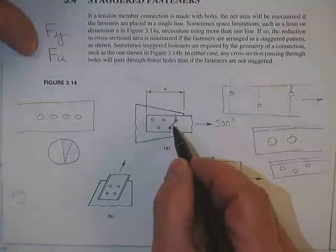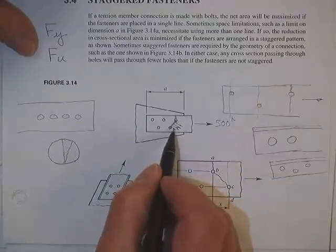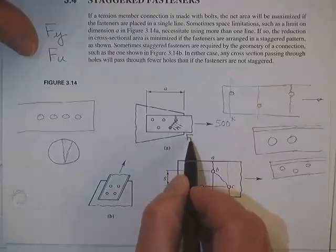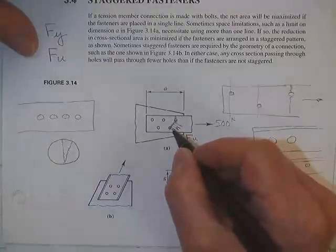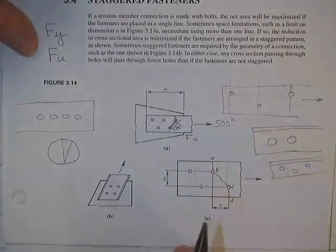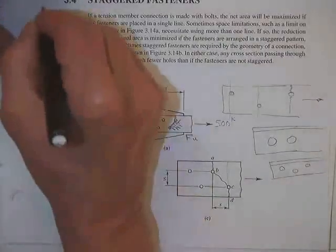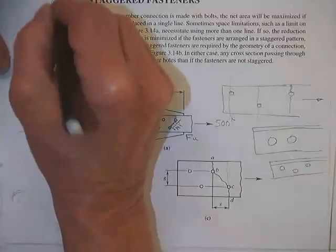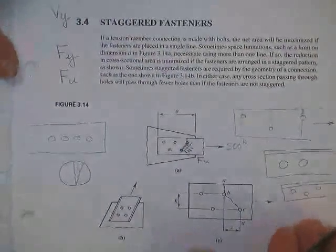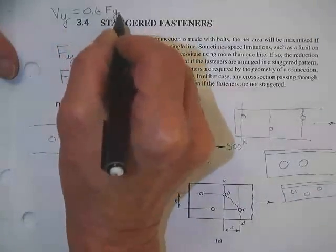What happens is if you test a piece of steel across here like that, you find it has some tension stresses, and those rascals can run on up to F sub u. But unfortunately, steel is kind of weak in shear. Matter of fact, almost all of these numbers are 0.6 F sub u, 0.6 F sub y. And it is so common, we don't even have a V sub y. We don't even have one listed anywhere. You won't find it anywhere. If anybody wants to know what it is, it's 0.6 F sub y.